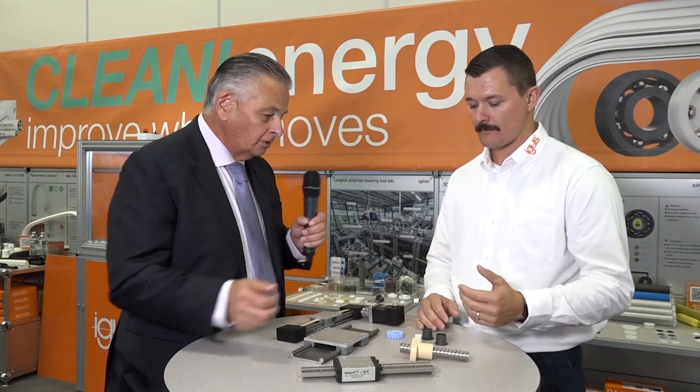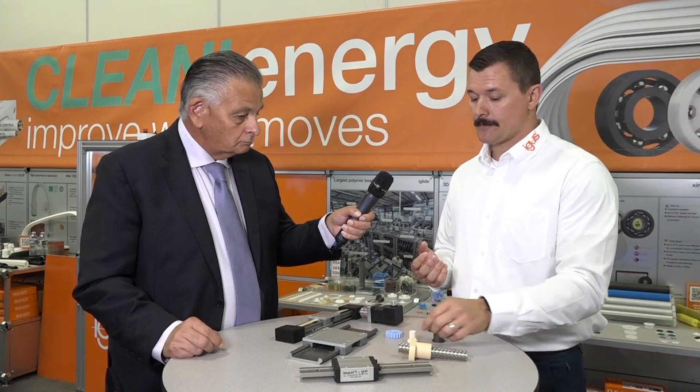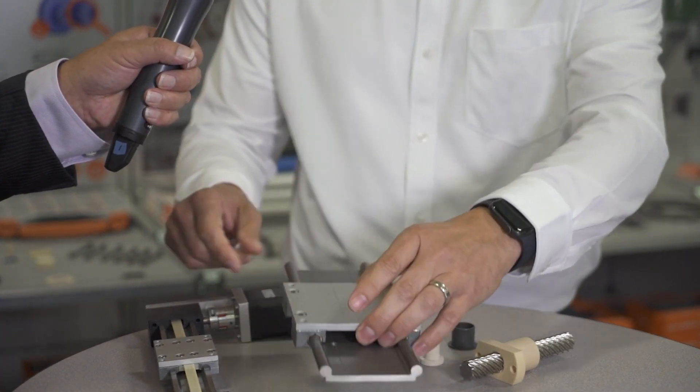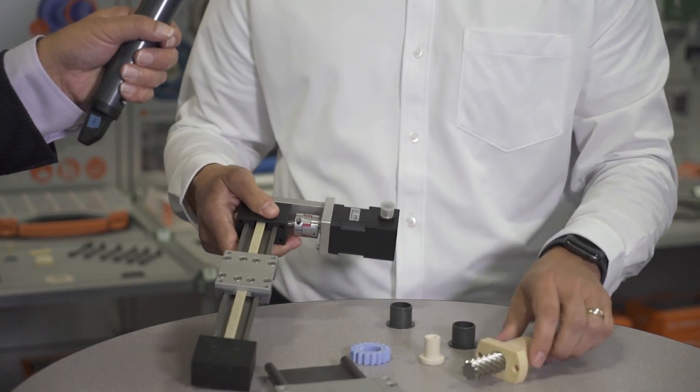So now I'm joined by Josh Lewis. He deals with the dry side of the materials here at IGUS. On the table here in front of us we actually have some of our plain bearing products, some of our lead screw, 3D additive printing products, and then some of our linear products. All of them are based off of a dry running polymer, so they're all made with a self-lubricating property, with strengthening fiber, and then with a thermoplastic — and that's why we call them tribopolymers. Each different material is optimized for gliding on a metal rail, or we can now run on wood products or other plastic shafting as well. We combine them into linear systems with a plastic liner and a metal rail that the carriage slides on, and we can also add a drive system — whether it be a belt drive or a lead screw — to drive that carriage back and forth.